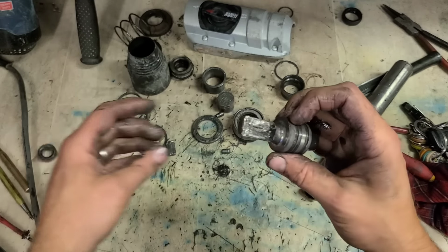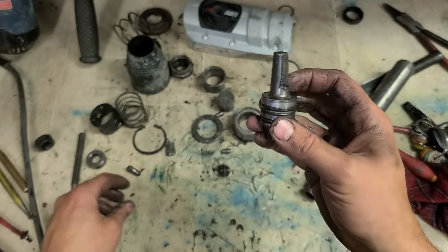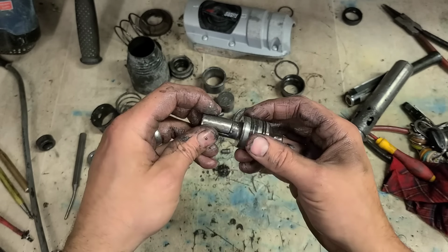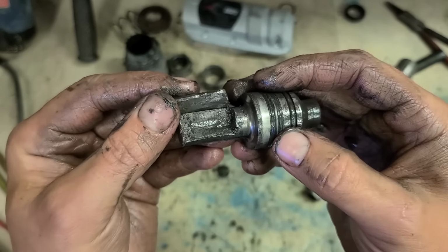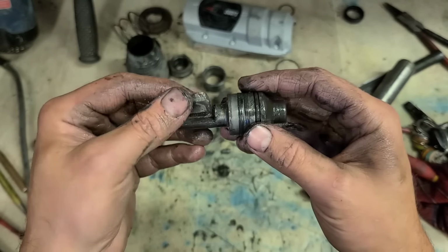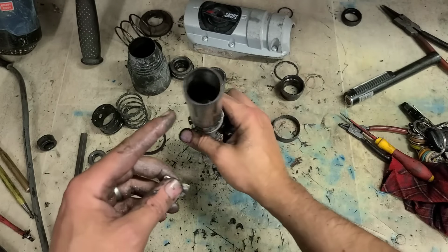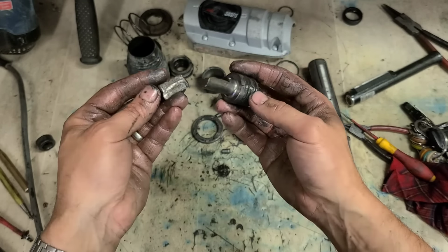She's all chewed up. Look at that. Never seen that with a Bosch before. I think that's the first Bosch hammer I've ever seen a striker pin break on. I think somebody just cut that out. There must have just been a fault in that during the manufacturing. There's been a hairline crack in it. Eventually gave way, snapped, jammed up the striker bolt inside the tool holder.